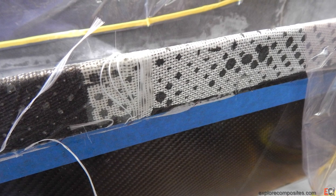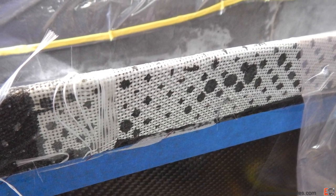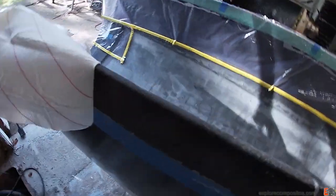Did one little repair on the inside where I had ground through the foam, cleaning up the inside. Demolding that upper edge, taking the bag off. I should have done plus-or-minus 45 fiberglass for the breather as well — that was a shortcut I took — but it looks pretty good.